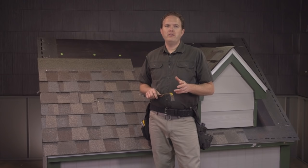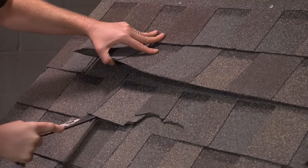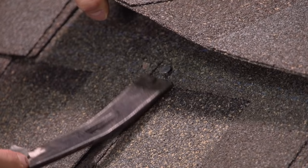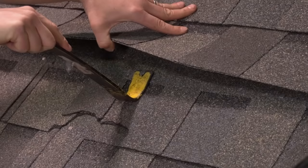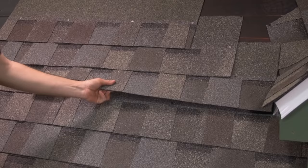Once you've broken the glue bond you need to remove all the nails that are holding the shingle down. To do this, look under the top shingle and locate the nails. Slide the flat bar under the shingle and pry up the nail. After you've gotten it loose and raised up, I like to come back in on the top of the shingle, press it down to the deck to reveal the nail, and then use the end of the flat bar to pop the nail out. Go along like this until you have removed all of the nails in the top of that shingle.